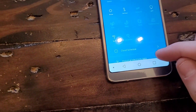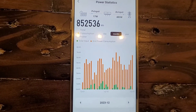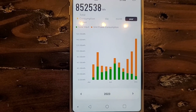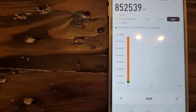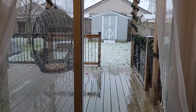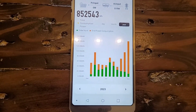I'll show my usage for the month — let's look at December since we're only a couple days into January. In December we peaked around 7.7 kilowatt hours per day. I've been running it a little more for January. For the year: December we did a total of 132 kilowatt hours from grid and 12.5 from solar. Into the new year we're sitting at 63 kilowatt hours from grid and 3 from solar. Pretty bad conditions for solar lately — not very handy at the moment, but it is still cheaper than running natural gas all the time.